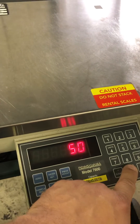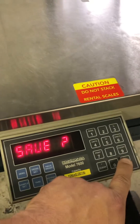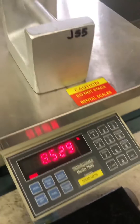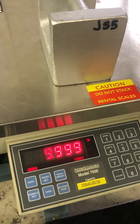At this point, you press zero, enter. It asks you to save — you press Units to change the no to yes, and you press enter, enter. That's how you calibrate or adjust the calibration level on the Pennsylvania 7600.